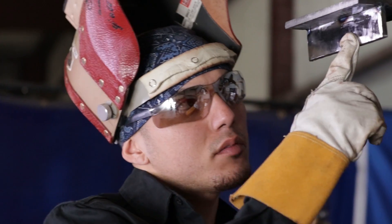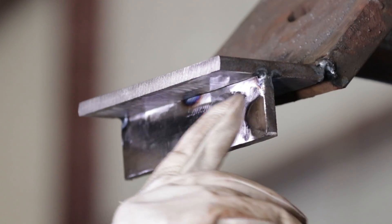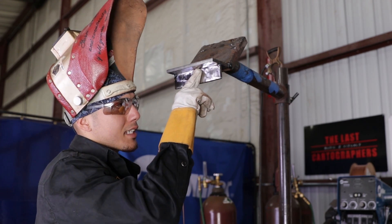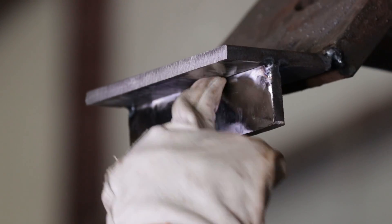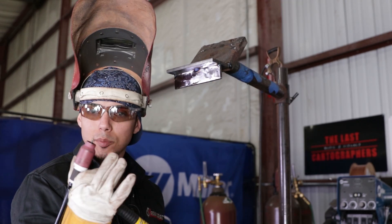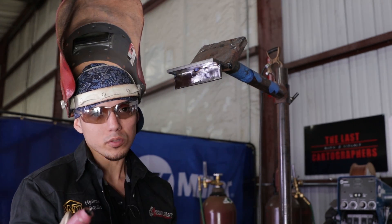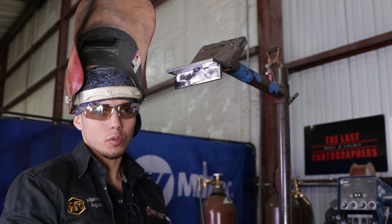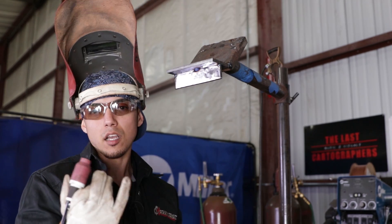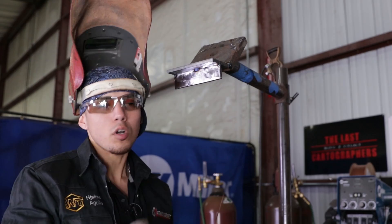I have it tacked up in the 4F position. These are some 3/8 plates. Make sure to grind your mill scale really, really clean, especially for TIG — this plate and this plate as well, grind it real clean. Make sure to tack both ends, don't tack it in the middle — or you can tack it in the middle because as soon as you get to it, you can wash it in and go across, but keep it clean at all times. Number one. Number two, make sure you have a sharp tungsten. We're using a 2% lanthanated tungsten — that's the blue kind. Make sure it's sharp at all times. If you have a dull tungsten, that puddle is not going to form the way you want it to and you can't control or manipulate it the way you want. It's going to get nothing but trash. We're using a number 10 cup — it can be a number 8 cup as well — but we're essentially throwing a root pass and a hot pass. This is a basic TIG tutorial for the overhead position.